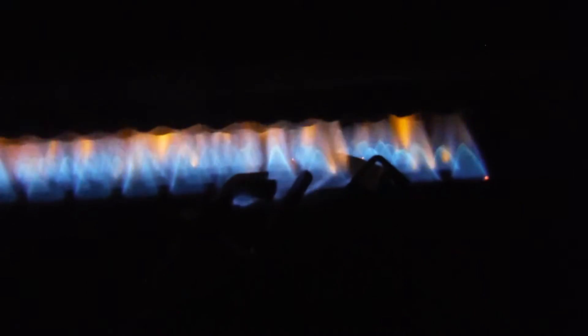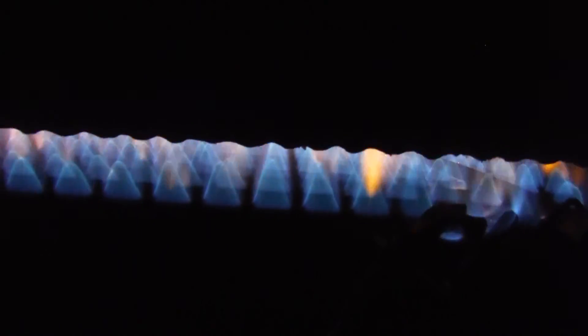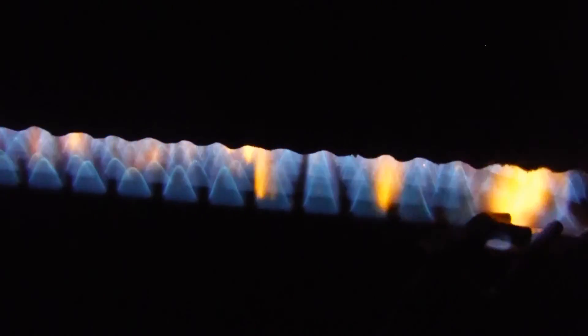On this right end, which is where the flame rollout was, they're all very hot. These are just items you want to look for on an inspection when you're doing a ribbon burner. It's much different than doing a standard setup with a jet type burner.